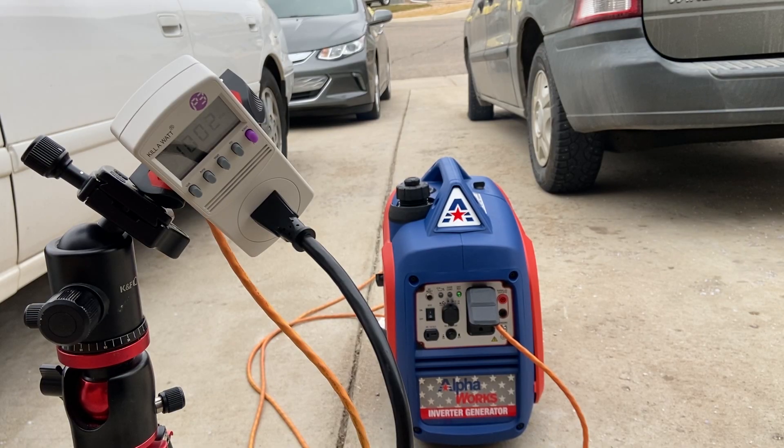The next one I was trying to get as close to halfway as possible, but I overshot it by about 100 watts. Basically what I did was plug in a single burner rated at 1000 watts. With that kind of a load it'll run for 5.27 hours, which is close enough to the Amazon rating that I'm not really going to question it. If I took that 100 watts off, I'm sure it'd be right around the six to seven hour mark. So the Amazon listing is accurate with this one.